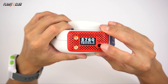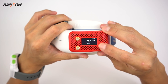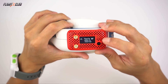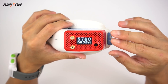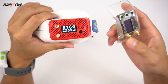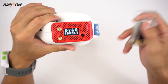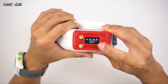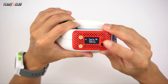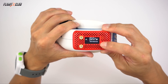To go through the menu, you just push down on the little button. From here you can change your bands by going right, and then there are your channels. This is a spectrum analyzer. The downside of the current firmware on this Rapid Fire is that it doesn't have a band or channel scanner like the Furious — so if I build a new quad and I don't know what channel my VTX is transmitting on, I can't auto-scan. You can use the spectrum analyzer to find the frequency and then manually change your channel to it, but it's a bit of a hassle.